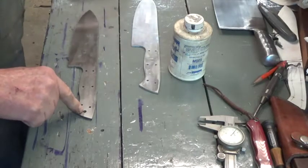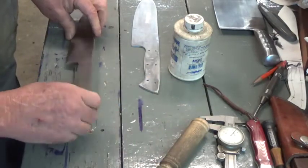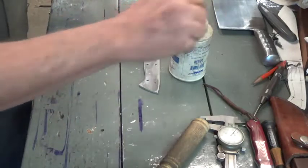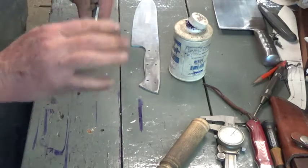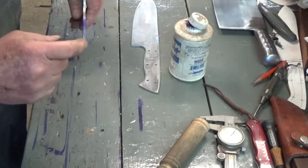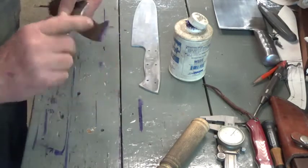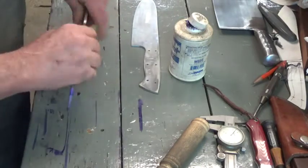Now the areas we're going to be exact about: this back edge where we're going to scribe twin lines to show where our tang taper is going to end up. Really the only part of those two lines we're actually focused on is the very point back here - we're going to meet our layout right back at the point, and then it'll get a little thicker as we go this way. That's going to get everything tapered down evenly. If we try to meet that thickness all along - that being at an angle - it is going to be off, so you have to take that into consideration.